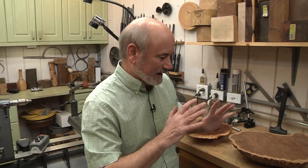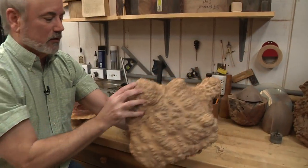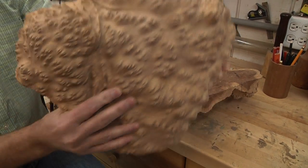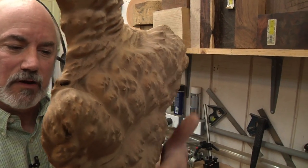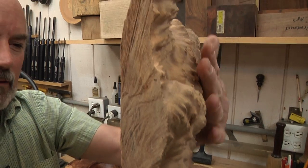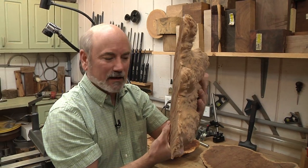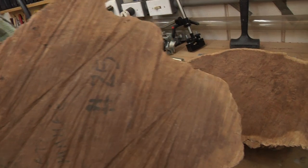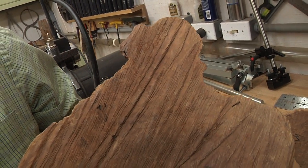Every burl is different, so you have to figure out what you're going to do. Here's the third burl he sent — it has some inherent problems. It's pretty thin right here and bulges out, so if I'm trying to make a bowl or dish shape, I don't have a lot of room. It could be about an inch and a half, maybe two inches deep when I'm done. But the payoff would be these flying wings and the natural edge. It also has a lot of opportunity for failure, so that's why I'm going to do this other one today.